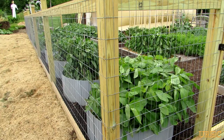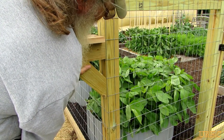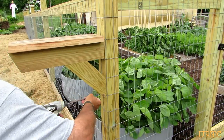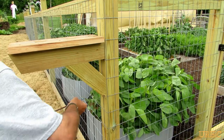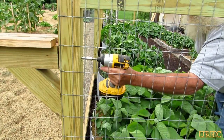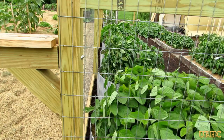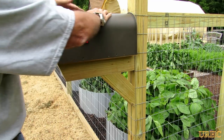I'm hoping this will help us keep track of the tools and spend less time looking for them — my wife's never too happy when she's got to spend 20 minutes trying to find a little trowel. It's just a couple screws from the outside to mount it, then I came back from the backside with some real long lag bolts. The problem was the impact wrench driver was strong enough that I snapped the heads off just under the surface when they were almost tight — so I couldn't pull everything together completely, but it's together firmly. I may have to try to get that little gap out of there someday.